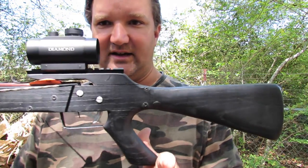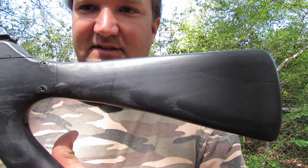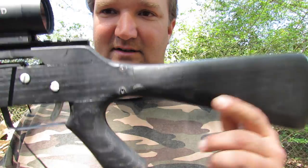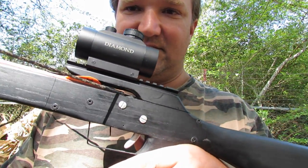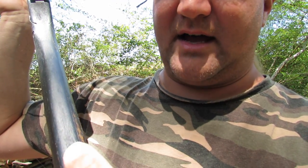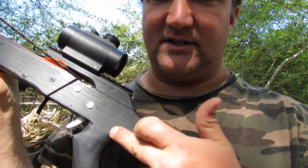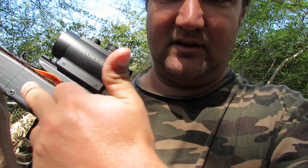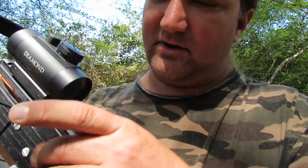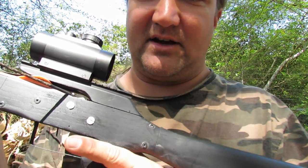Of course I tactical'd it out — I made it into an M16 design. I basically put my M16 airsoft gun on here and traced out the pattern on wood. I don't have any routers or anything like that, so I actually laminated two pieces of quarter inch oak on the outside and a half inch pine on the inside, squeezed it all together and glued it. That way I was able to just leave the oak part hollow right here in between the red oak, leaving me a cavity in between the two quarter inch pieces of red oak.